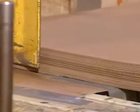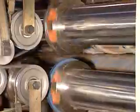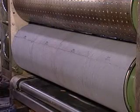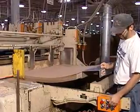The corrugated packaging industry is continually facing new challenges from customers who demand higher quality products and more intricate die cuts with minimal lead times. Box makers worldwide have come to rely on soft anvil rotary die cutting to meet these customer demands and maximize productivity. With a soft anvil system, the key to maintaining required quality is a consistent urethane cutting surface. Furthermore, the key to maximizing productivity is to minimize die cutter downtime.